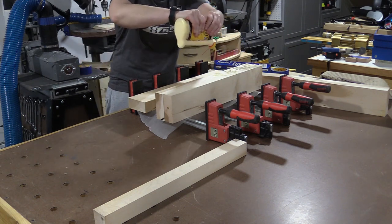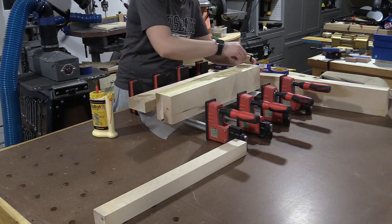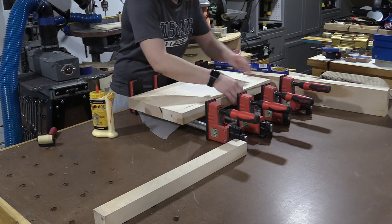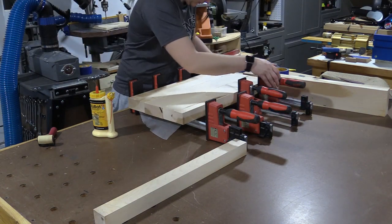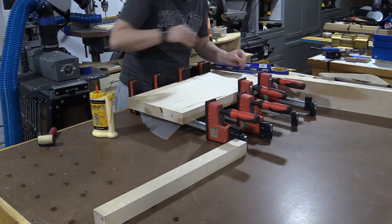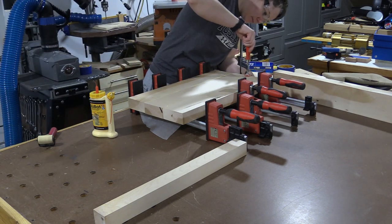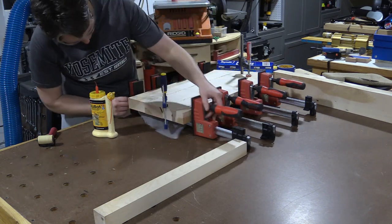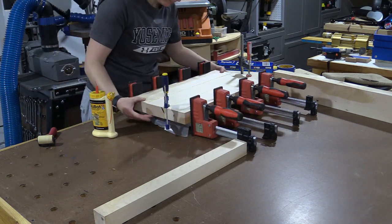I really like these glue bots because the glue comes from the bottom so there's always glue at the ready. I really like these little craft rollers for being able to evenly distribute the glue very quickly, especially when you're doing bigger glue-ups. High quality parallel bar clamps are one of the best investments I've made for my shop. I really like these Besseys, but there are several brands that make nice models. I wax the clamps so that any glue that gets on them comes off easier, and I use wax paper to prevent any from getting on my clamps.